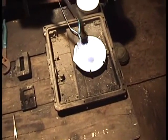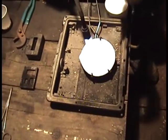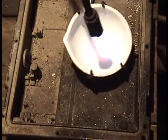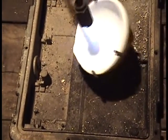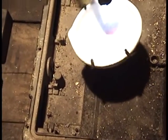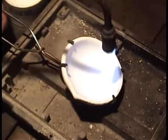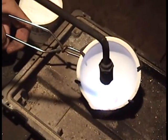You don't want to drop it all in the bottom of this dish — it's just a pool. You don't really want to just drop it in there and try to move it around. That's not going to work. You can't just put it in there like water and spill it around. You need to kind of coat the dish, and as you melt it, it will bond with the dish and spread out like wetting the surface of something with water.